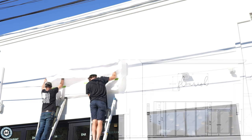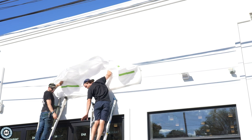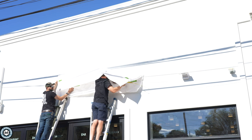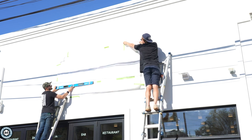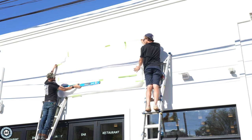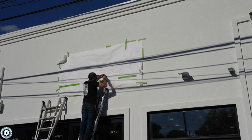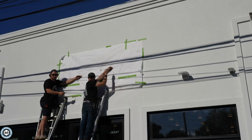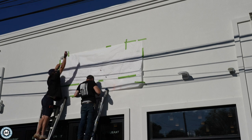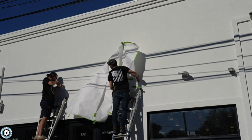Mac and I had to go up there, measure everything out, and lay it out perfectly. Having a full-size paper template is really nice — aside from blowing around in the breeze, it was easy to reposition. I can use a level to reference off the graph paper lines, tape the template to the building, and transfer all the standoff holes through the stucco. I used a couple of standoffs to hold the paper template in place just in case the tape failed, and then we used some ice picks to poke through the exact holes and countersink through the stucco so our screws would have a nice reference to go into.